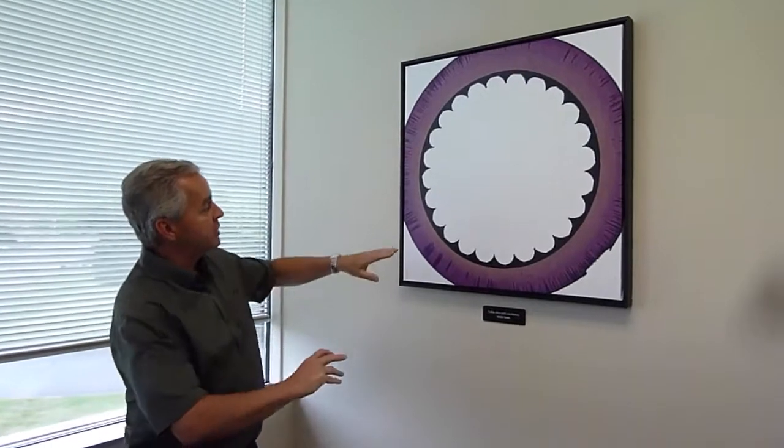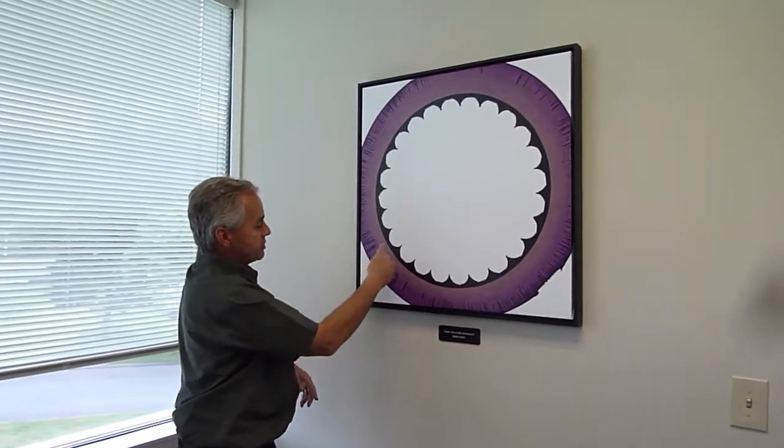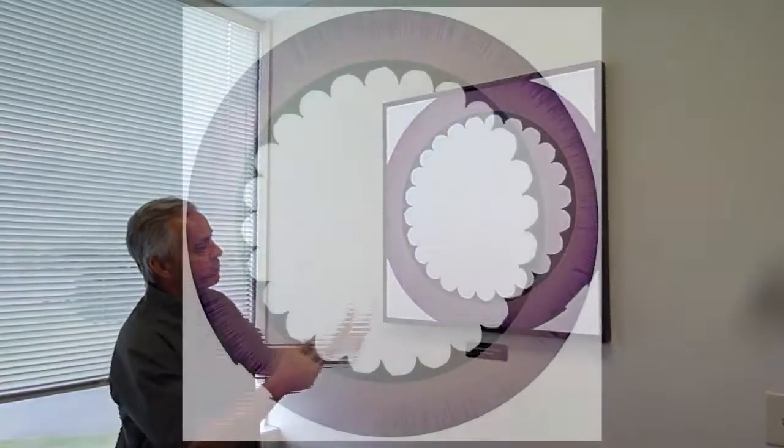Let's look at this photograph, which has lots and lots of water trees in it, and they're all growing from the outside in. Again, you can see that in this case you have a really large conductor, and so the stresses between the inside and the outside are pretty much the same. And as I mentioned, you have the water source on the outside, so the majority of water trees often grow from the outside in.